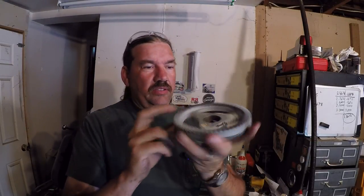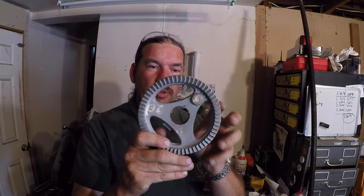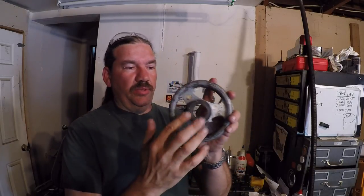The last piece we got is the ratchet wheel. This is a machined surface in here and there's also a threaded hole. This side right here is machined and it rides against something, so that needs to be machined flat. We've got to plug this hole up and build up a machining allowance.